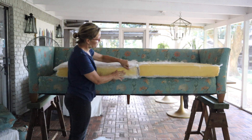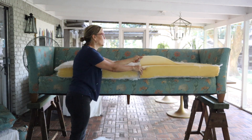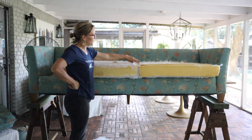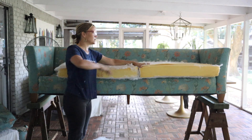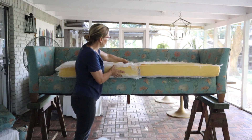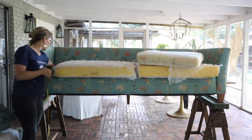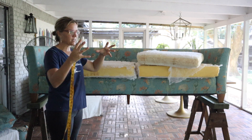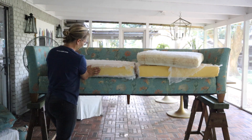If you steam your foam corners, it'll plump up those corners. See, now this fits nicely together. They put a little piece of foam on top here just to give the cushions a little bit of a crown. I'll pull that off so there's not this space in between. I could go ahead and buy another one of these the whole length, which I might do. But once this is glued together, if you glue this seam nice and tight and then wrap the whole thing with Dacron, you won't even see that seam anymore. Your foam should be a little bit deeper than your sofa by about an inch, because you want your cushion cover to fit snugly and kind of suck in that cushion. So these need to be 26 inches, which is an inch deeper than what the sofa is, so when I put my cover on there it'll be nice and snug.